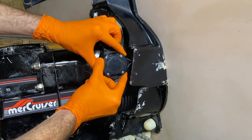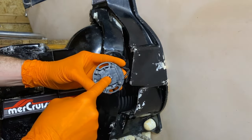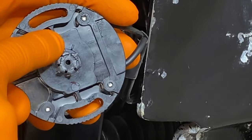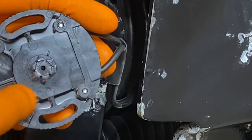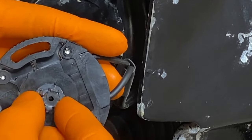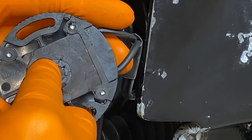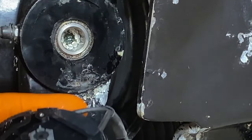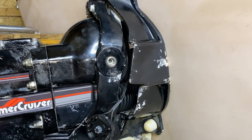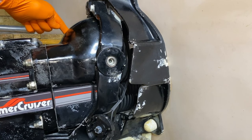With the two screws removed, carefully pull the trim sender switch straight out and be cautious of the electrical wiring. On the back side you have a rotational mechanism. You can see the notch on the rotational mechanism and the beveled notch on the inner wall of the switch itself. Carefully turn the rotational mechanism until the notches match up — only one notch is beveled, and that's the one to align with the inner notch on the wall. Then carefully lower and rest the trim sender switch down. Next, get back inside the boat and turn the wheel clockwise to shift the out drive to the right, exposing the opposite side trim limit switch.